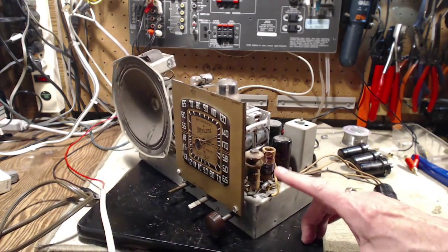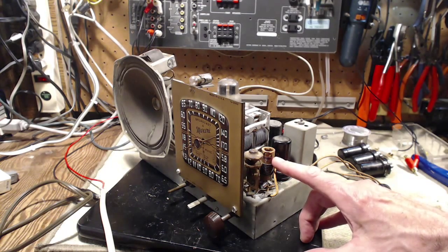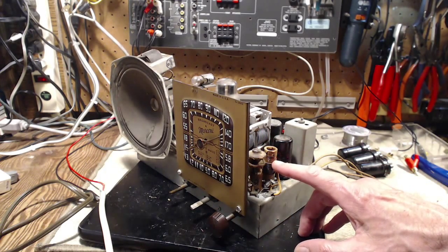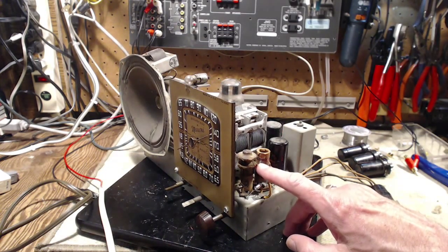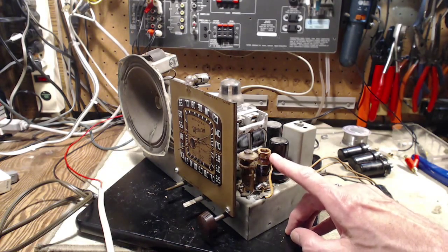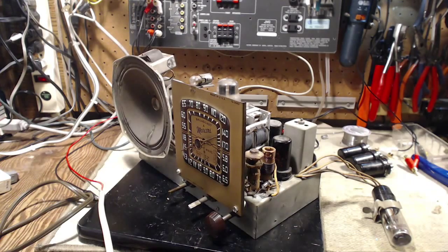On the other hand, this coil, as I've seen earlier, has been fiddled with. It sure looks like it's been repaired after having a break on it. Part of that repair process can involve removing one turn of wire to provide the slack to make the new connection. And there certainly is slack in this little coil here. So removing one turn, and there's not an awful lot of turns here to begin with, maybe 15. That's a fairly significant change in this coil. So let's start by making some observations here.